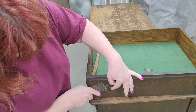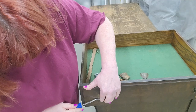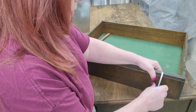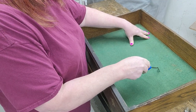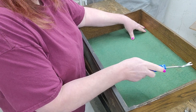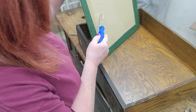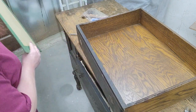There are these little pieces on the front that have one tiny nail in them, so we're just going to pry those off. These tools are great for taking out staples that hold on backing pieces and things like that. Usually with felt in a drawer I have to put denatured alcohol on it and work like the dickens to get the felt out of the bottom, but whoever did this one — I love them to pieces — they just covered a piece of cardboard and popped it in. The bottom of that drawer looks pristine!